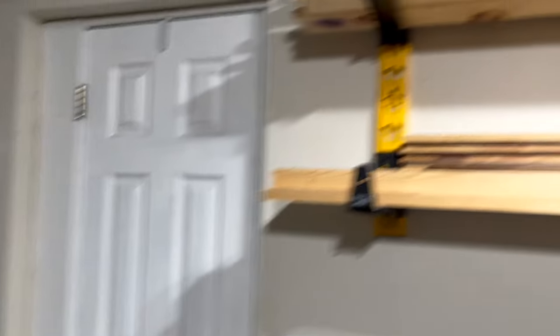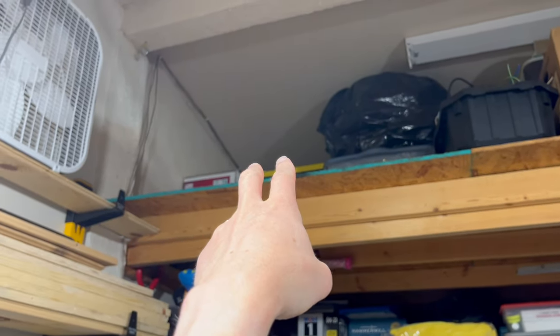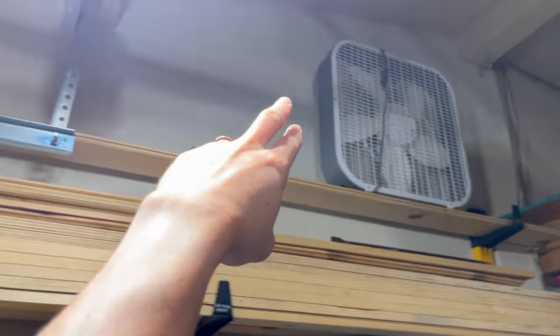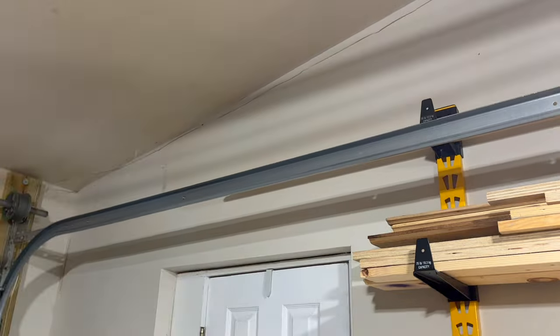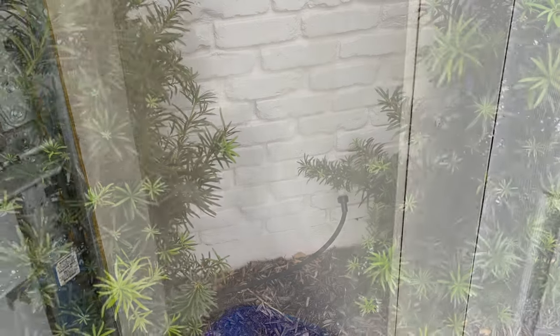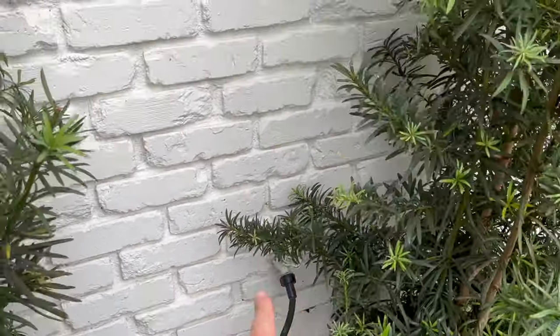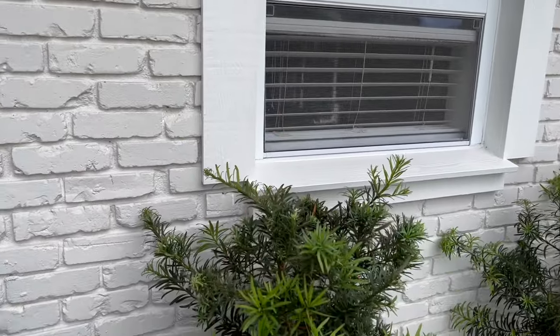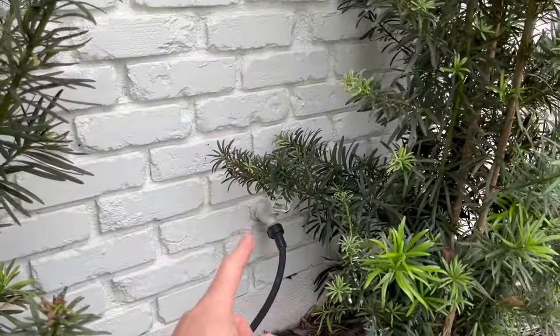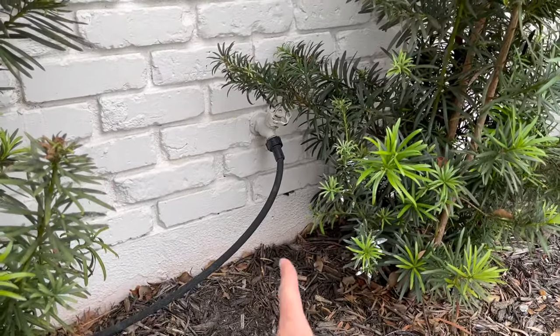Here's the other side of the door — I'm in the garage right now. That's where I drilled those two holes and have the PEX coming through. I'll be running two insulated lines all the way across this wall — won't be the prettiest thing in the world, but it's going to be the best way to do this. Then I'll come down this wall, drill two holes, and that will go into those cabinets in the kitchen. We've also got a few outdoor hose bibs to replace — we've got one here, and we'll probably tee off from in the kitchen and come out through that brick wall.